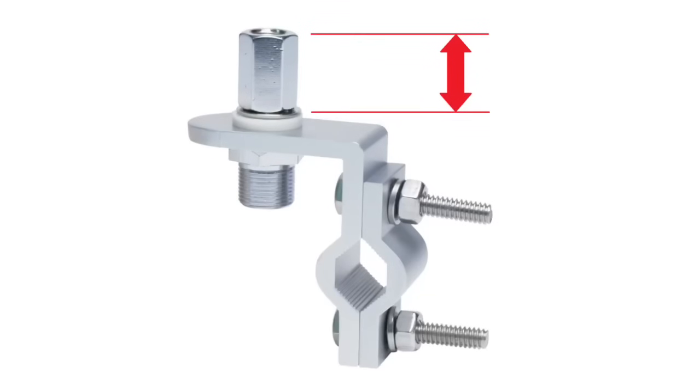One thing to remember when measuring: if you're using a mount like this, the bottom threaded insert where you attach it is actually part of the driven element, so you have to include that length in your quarter-wavelength measurement. That's something I learned the hard way — I kept wondering why I always had to bring it down another 20 millimeters or so to make it resonant. If you include the mount length, you might hit it dead on the first time.